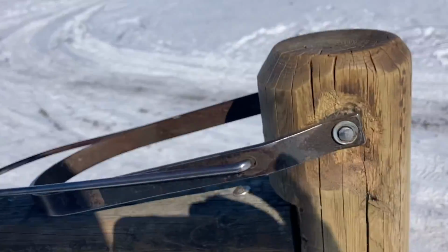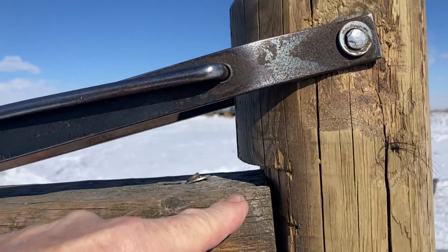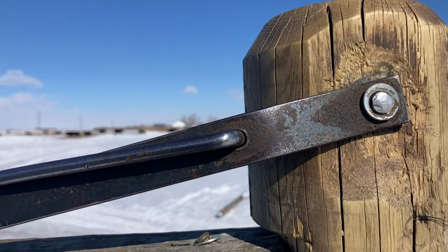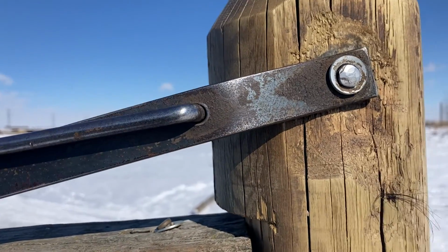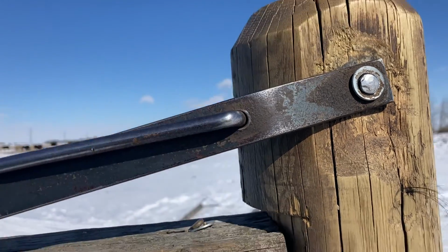The trick is when you're mounting these, when you're building your corners, you see how the corner here is about 6 inches above. It needs to come over center, so always build your corners so that there's room for one of these to come over and land on that cross brace there. And I've never had one of these break built this way.